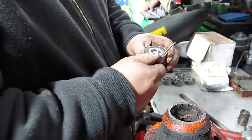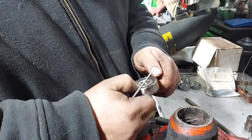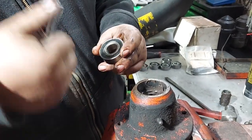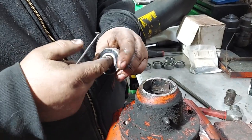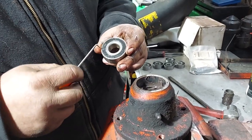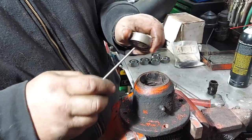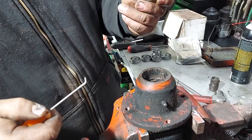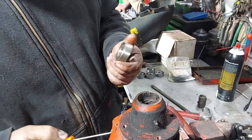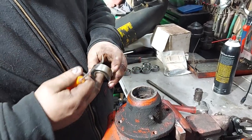Nowadays I don't care where you get your bearings from — they're not as full as they should be. So just pull one side lip off, pack it with a good quality grease, then put your lip back on. We do it for wheel bearings, mower bearings, and snowblower bearings — just the way the world is today, there's not enough good grease in them. We've got a video on doing wheel bearings and how to repack and reinstall — very similar bearing, so check that video out. These are brand new bearings and we're going to leave these sealed on both sides. You'll get a lot of life out of them if they're packed full of grease to start with.